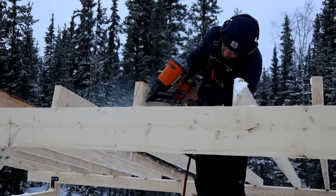These are some of the 2x4s we got, and these are gonna be our trusses to support our front roof overhang. Let me show you what I'm talking about over here. You're gonna come into the sawmill and we are gonna have a small overhang on the front. It's gonna be about 4 feet. That's gonna be to keep snow out, keep rain out, things like that.